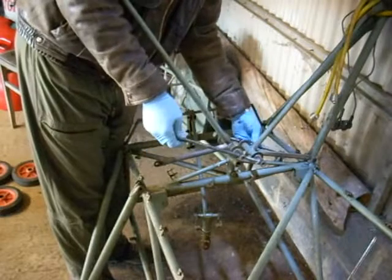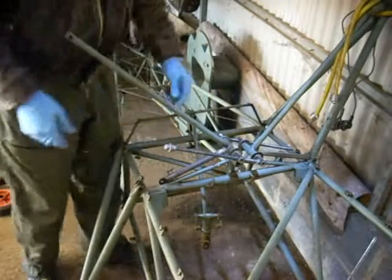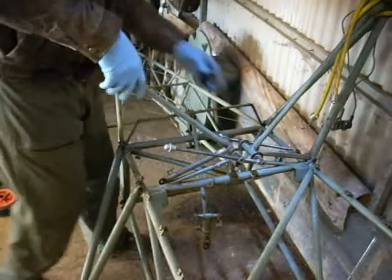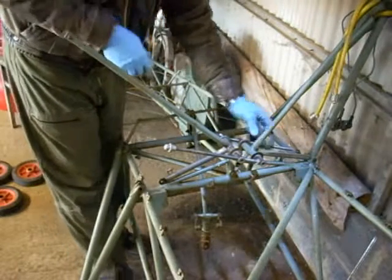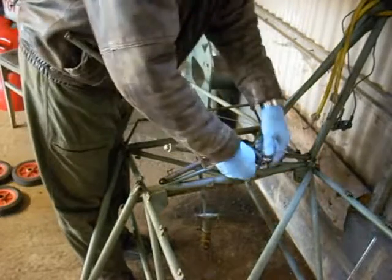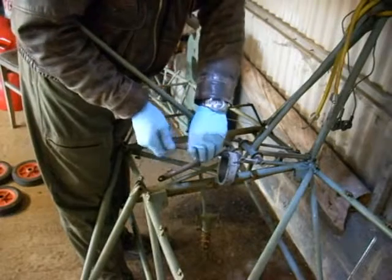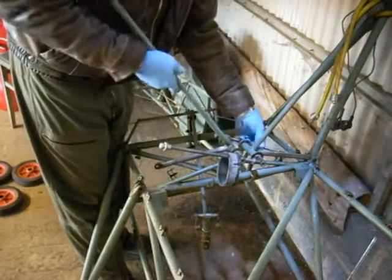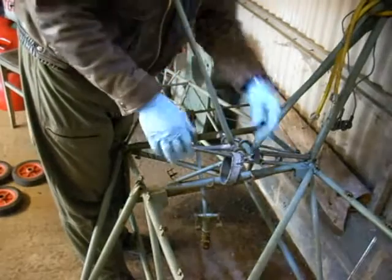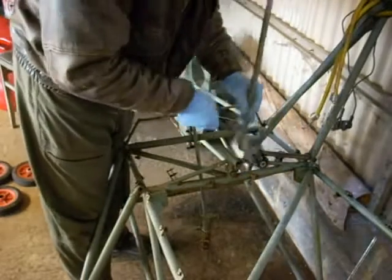One of the longest jobs of doing this on the actual aircraft will be trestling the aircraft and supporting it carefully so that you're not going to damage it whilst you've got the weight off of the undercarriage. For the purpose of the test, I'll just do the front end here, because I've only got one set of bungees, and I'm only testing one set, because my strain gauge won't do a double set. The test is purely for the purposes of seeing how that 1080 bungee compares to the Neiman ring.